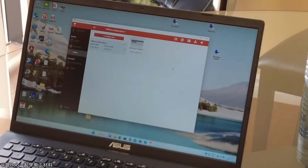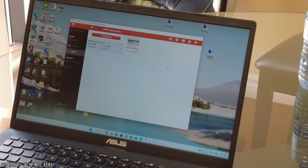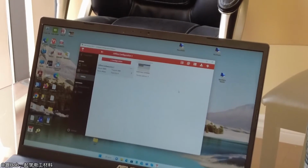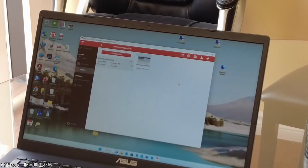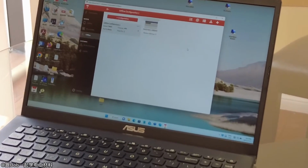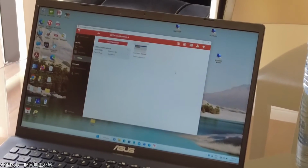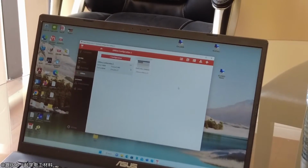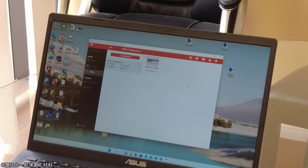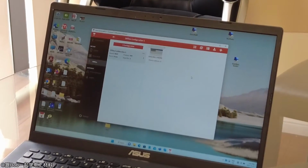For this kind of meter, can you do a sub-metering system? For example, I have a plaza with 10 commercial units, each unit 600 volt. Can we still use this kind of unit? Yeah, you're going to have these meters here, but we have what's called the UWP. It's like a data concentrator and web server. What that lets you do is have technically up to 100 meters going into it, and you just go in with a web browser to view what's going on. You can add the meters to that, and it'll show you the energy consumption on each of the units, and you can look at the voltage or whatever on those units as well.